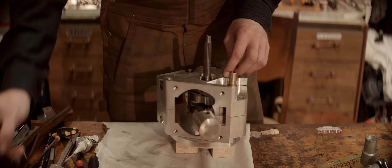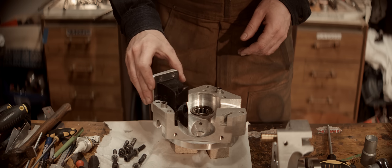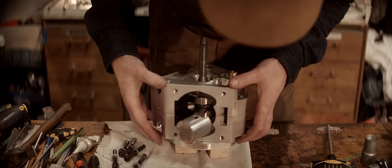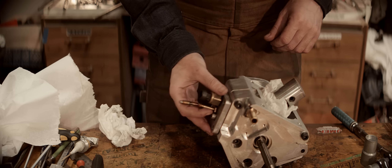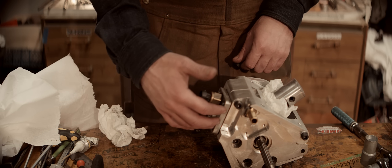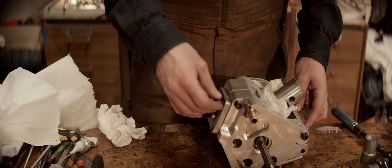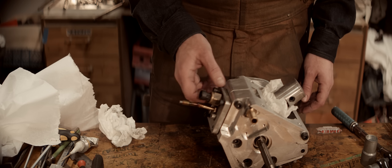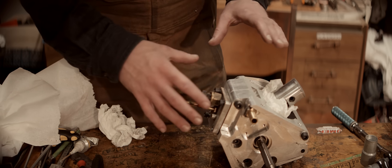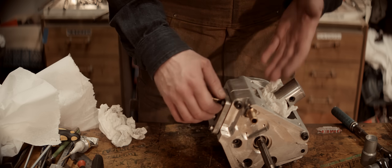Okay, let's go. Almost forgot this primary intake place-taker stuffer. This engine was meant to run with a primary reed intake and then that resonance intake would take over - that was the original experimental plan. The primary intake had - or the secondary, whatever you want to call it - had a fuel injection, continuous fuel injection, or constant flow, for working with an electronically controlled variator and staying at the same RPM all the time and under the same load.